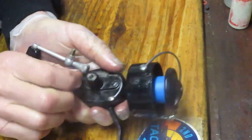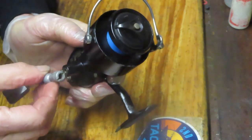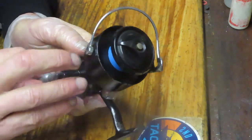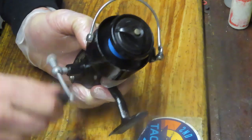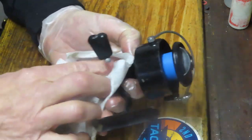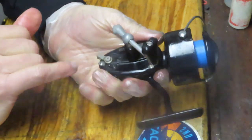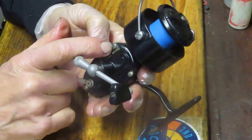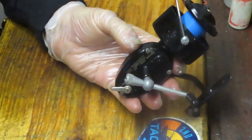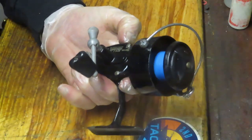So what have we learned? We learned that you can get the side plate off with a little bit of iterative drilling. Start with a very small bit, try to center it as best you can in the screw head — but only after trying a wider screwdriver blade and filing or using a Dremel tool if possible. If you have no other alternative, start with a small drill bit and work your way upward, never exceeding the outside diameter of the screw head. We walked out the stud with pliers and were able to replace it.